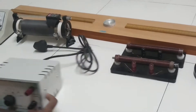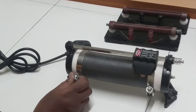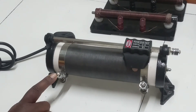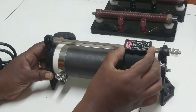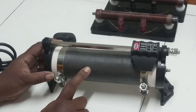The next one is this is rheostat. Here you can see we have the connections 1, 2, 3. Generally we use one down and another one is up — these two screws we use for the connection. By using this top knob we can adjust the rheostat value.